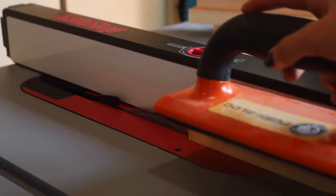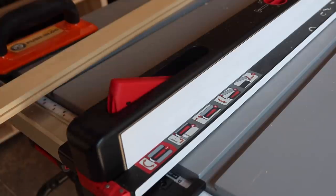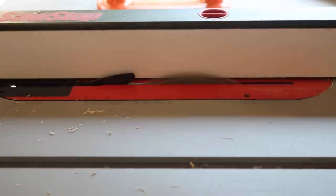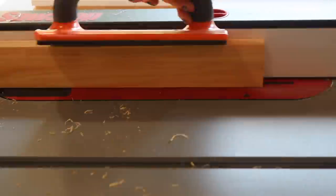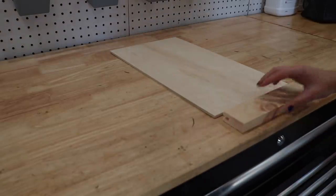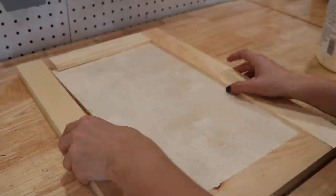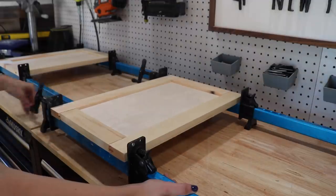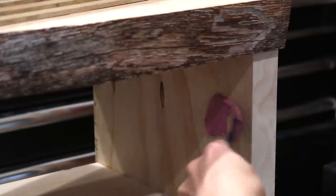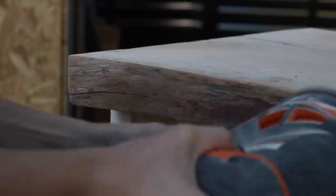Since I would be painting the cabinet doors instead of staining them, I decided to cut grooves into one side of each frame piece, gradually moving the table saw guide very slightly until the groove was wide enough to fit a quarter-inch piece of plywood. I'll use wood putty to hide any visible grooves once the frame is assembled, since I don't have a router table. Once all the frame pieces were ready, I cut quarter-inch plywood into the proper panel sizes, attached the panels to the frames using wood glue and clamps, and then filled any openings in the doors and cabinet using wood putty.